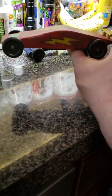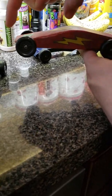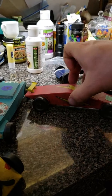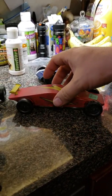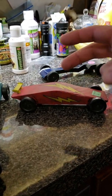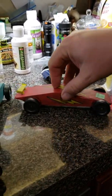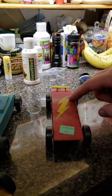What we ended up doing was casting bullets — these are actually .45 caliber bullets that we drilled in and placed just in front of the rear axle. The great thing is you can cut them down or drill them out to get your weight as close to the maximum allowed weight as you can. The amount of wood we took out of the top is pretty substantial — probably less than a quarter inch of wood remaining.